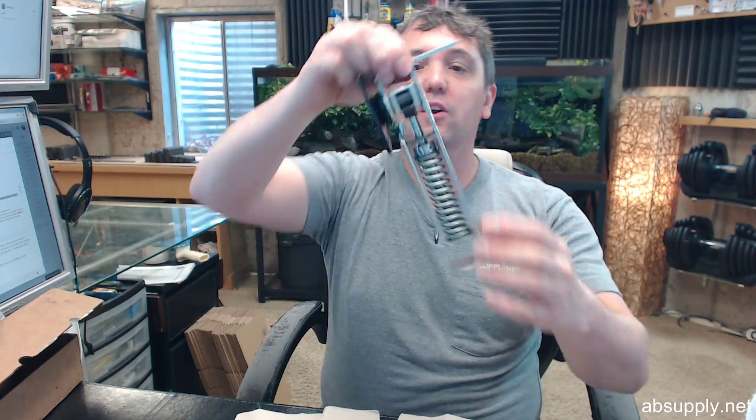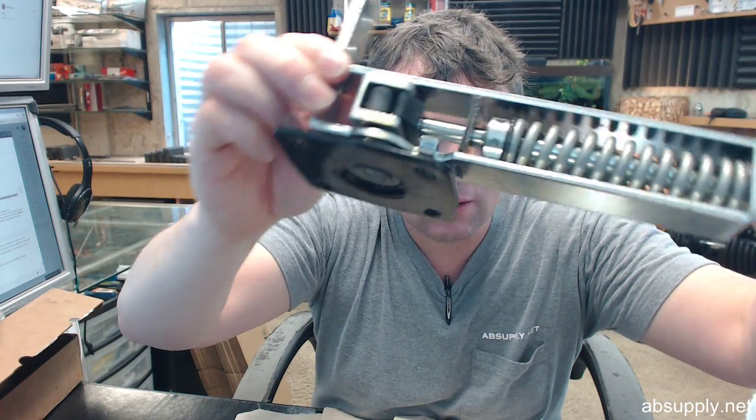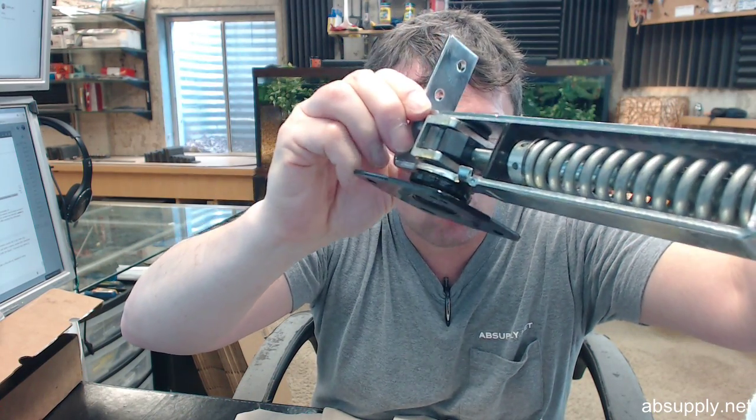If you ever hear any creaking that develops over time, generally you're going to want to get in there and lubricate that. You can see that it's literally lubricated now, coated quite well. And it's just all over the hands. You'll want to bring it back to a lubricated perspective. I like to use a 3-in-1 oil. You don't need very much. A small can, get in there with a few drops, operate the unit.